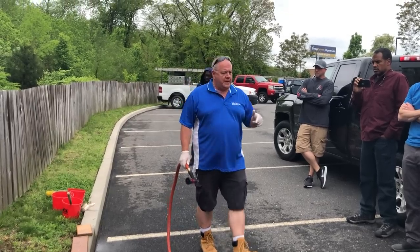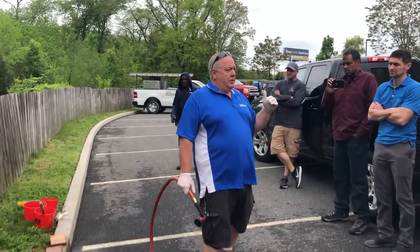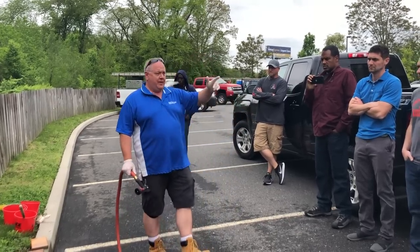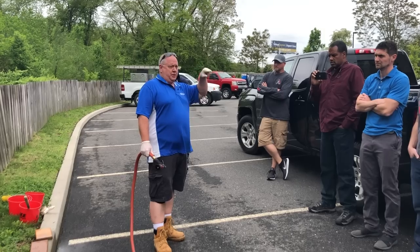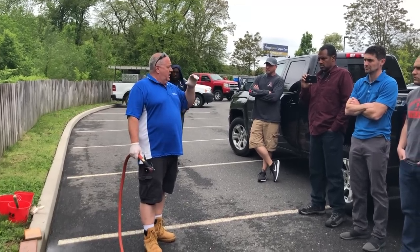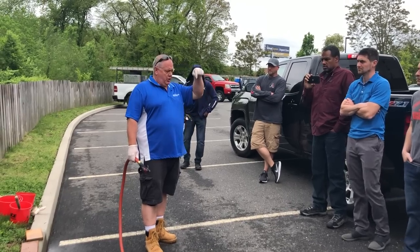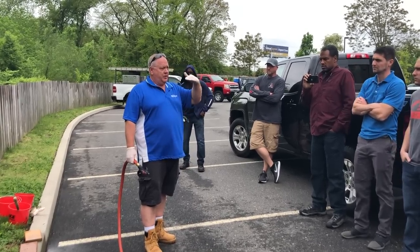When you're talking about water-based, same thing. Many of them are film-forming, but as you can see, some of them are penetrating, and those are the ones I have in there. The Deck Restoration Plus ones have sections of them, samples that are up on that front table. If you look at a side view, you can see where it goes into the wood. It doesn't sit on the surface.